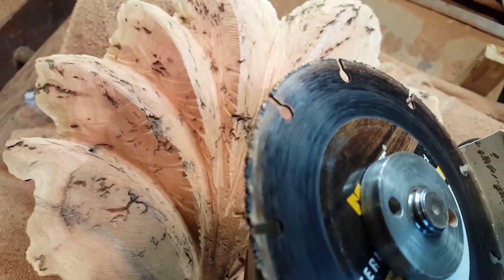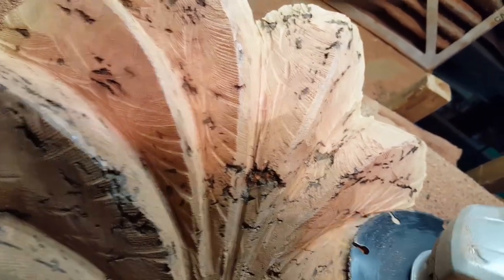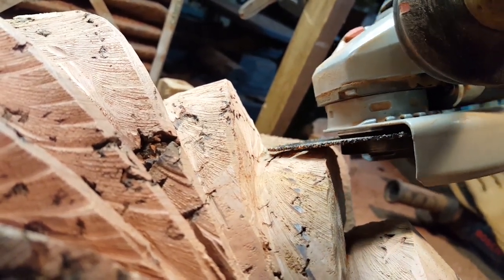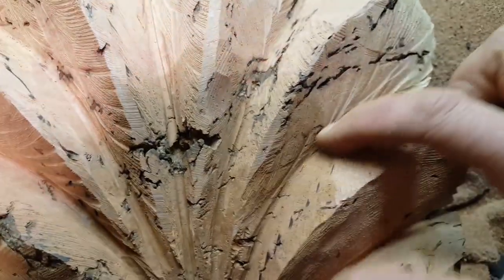I like that it only has the grit upon the very outer rim, and that I find useful because the body of the disc, this flat area, which is not abrasive whatsoever, can actually rest upon the workpiece, and I can use it as a guide to slowly tip my angle and creep into the cut delicately, and then like leaning back on your heel, get back out of it. And that's why this black paint is rubbed off here, is because I actually found I had great control in the groove by using that.